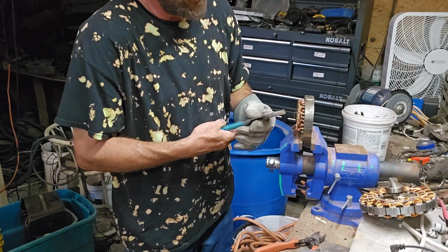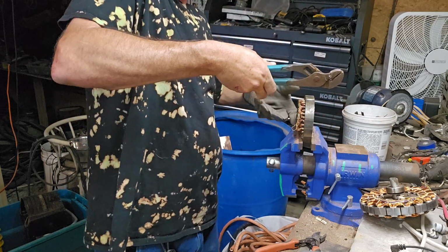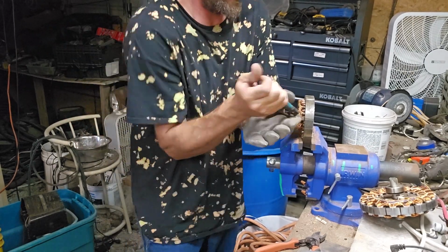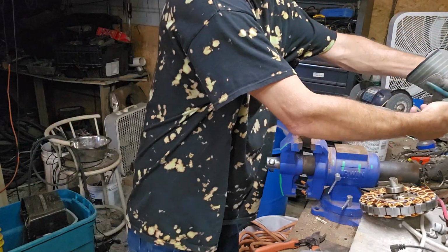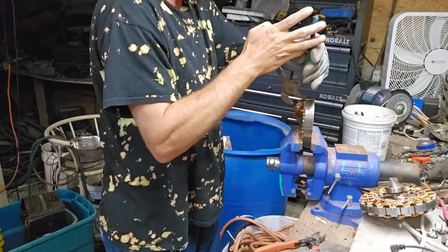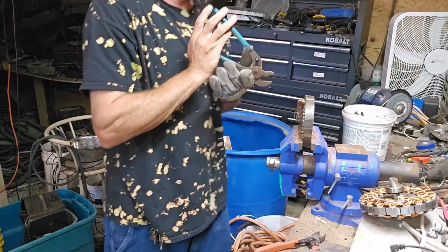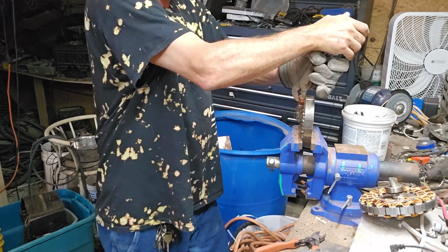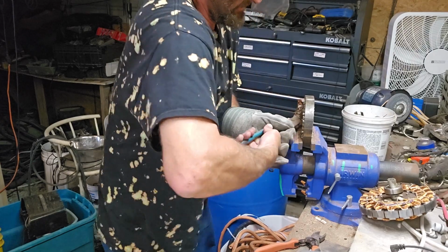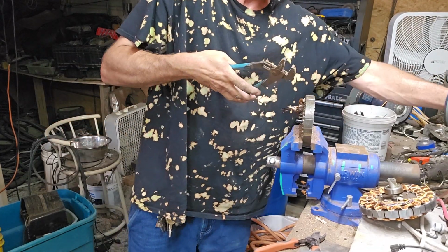I see a lot of people putting these motors in there, and they're prying here on the side, and they have problems with it shifting. If you get in here and pry to the front or the back of your vise, you won't have no problems. That thing is gripping, and it will not slip out. If you're prying to the side of it, it'll slip and move and everything else. I don't remember who it was, I told them pry from the front or the back. Anyway, you won't have a bit of problems.